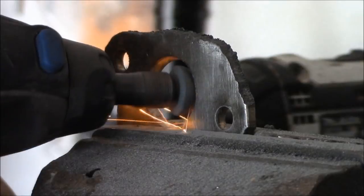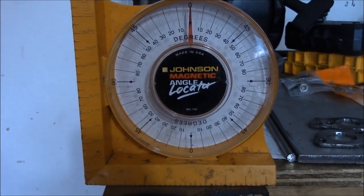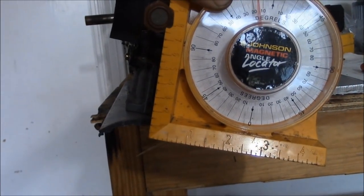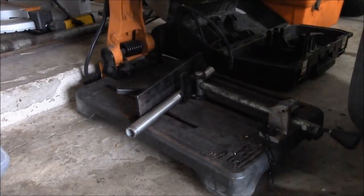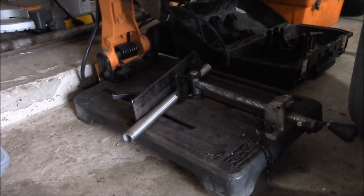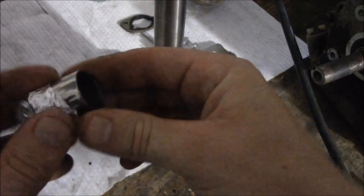There was a little bit of fine-tuning I had to do after I used the plasma cutter to get it just right. The old carburetor is at about a 15 degree angle, so I mimicked that angle through the intake and cut it on a 15 degree angle because the intake and exhaust are pretty squished close together. This part is my favorite part — TIG welding.